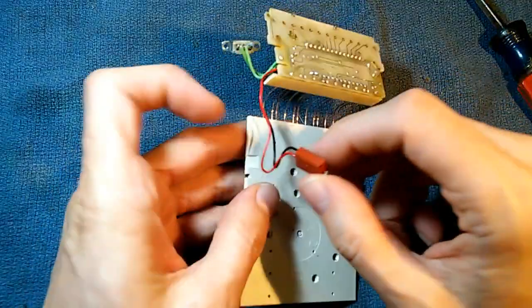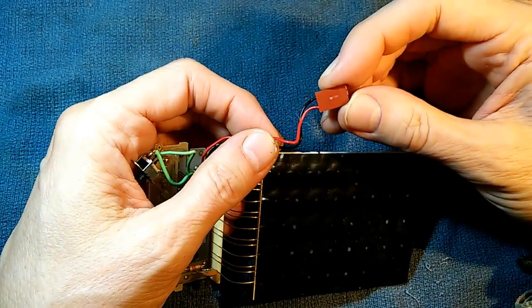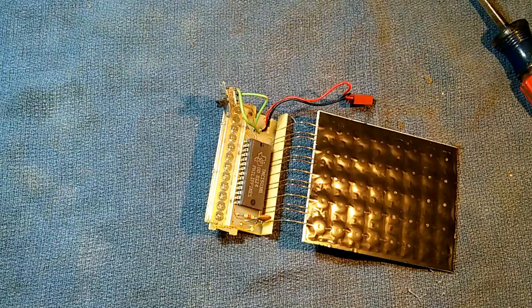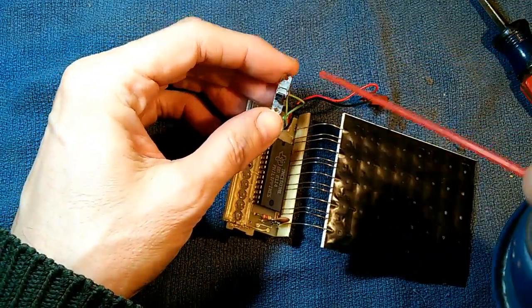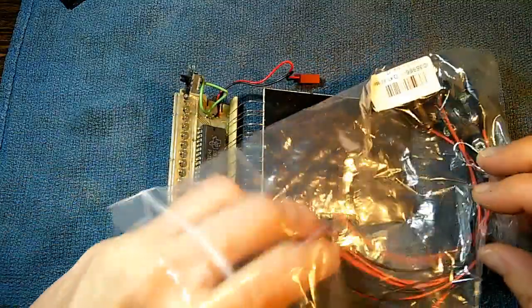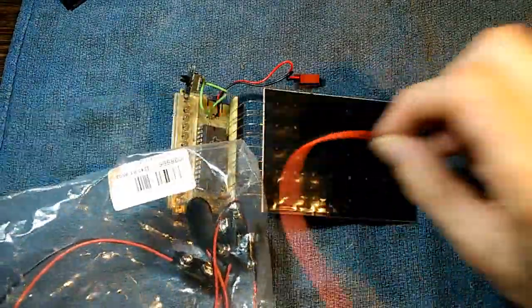Here is where our power supply cable hooks in — just two solder points. One very important thing to note about this connector: the red and black wires are the reverse of what you'd expect. The black is positive and the red is negative. Keep that in mind. While I have this apart, I'm going to use a little contact cleaner on the switch as it feels a bit stiff. You can purchase 9-volt connectors very easily and cheaply — I bought a whole bag from a supplier in China for no more than two dollars.